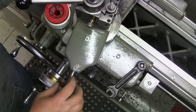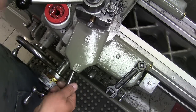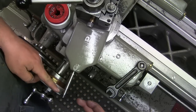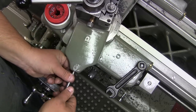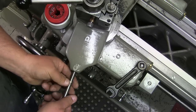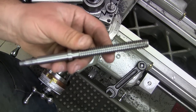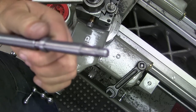Now I know all my measurements were spot on with this. They were all the same. I think maybe in another video I'll take the dial, because I have to drill two set screws to get the whole dial to fit on here, and frankly I don't want to go through that right now. The video was really just to make a spare compound screw, show some Acme threading and what not to do with direct reading dials. So I'm going to wash this up and we'll go take a look at it on the bench.